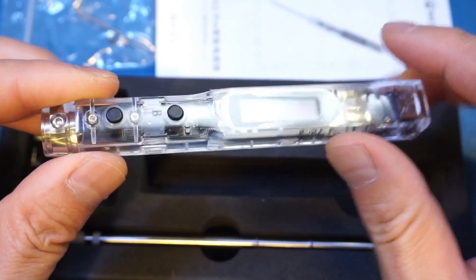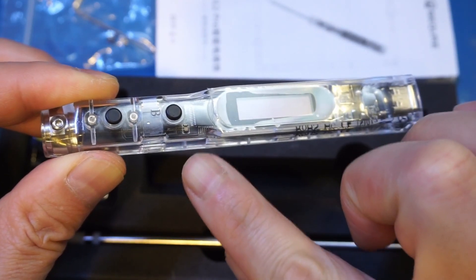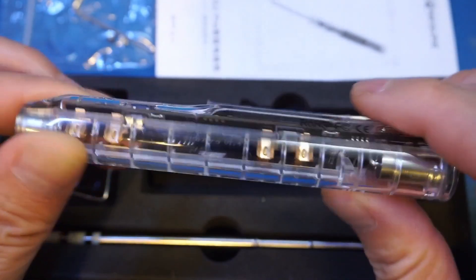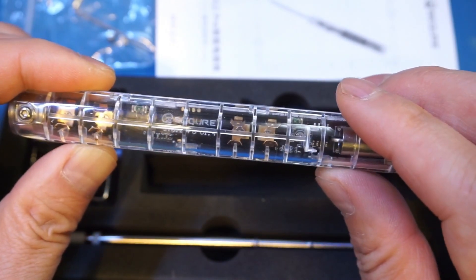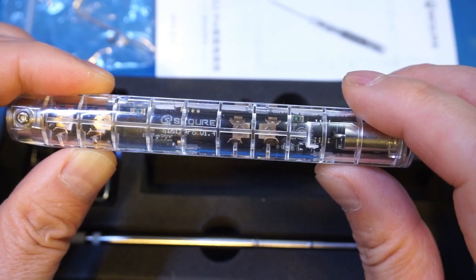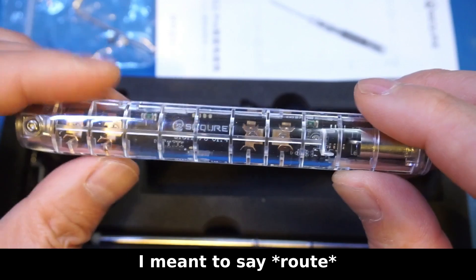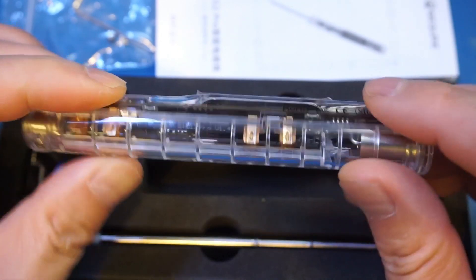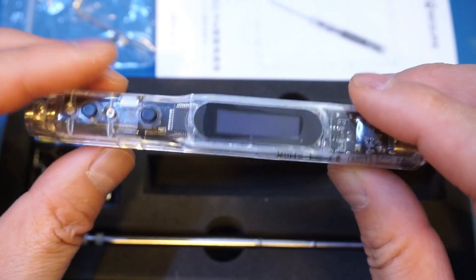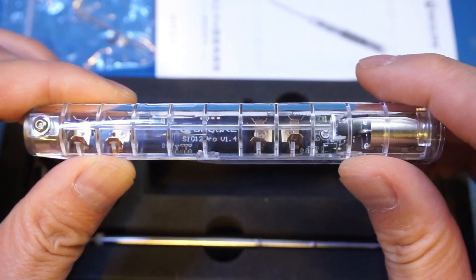You can probably see from this angle that we have a ubiquitous STM32F variant ARM Cortex microcontroller, and from the back you can see we have two sets of contacts for different sized soldering tips. Now, this is probably a four-layered PCB — I'm just guessing here — as they have to route these high current traces somewhere. Given the density of the components on this board, there's just no space for these high current tracks if they were using a two-layered PCB.